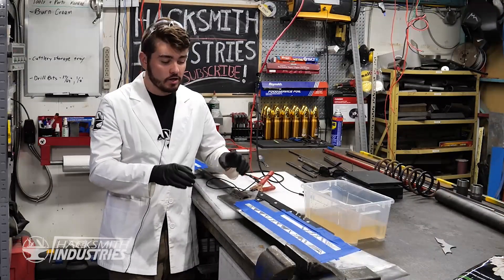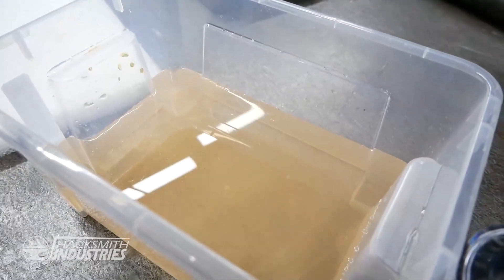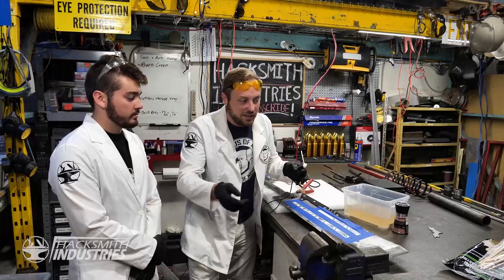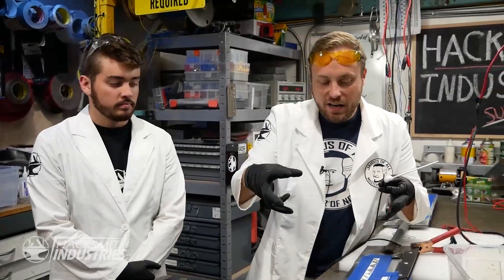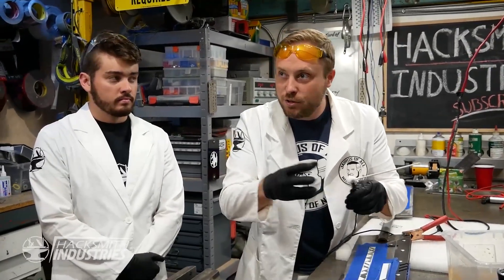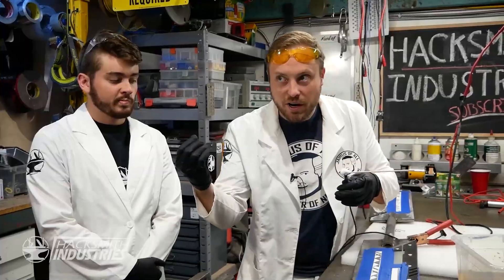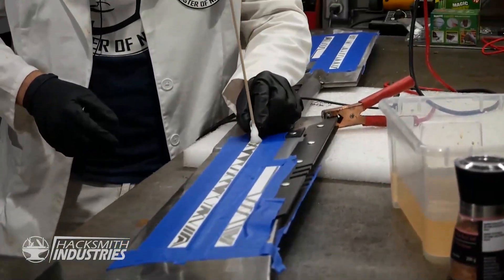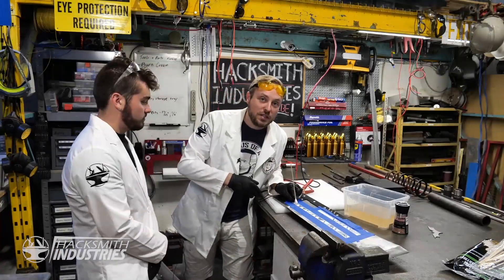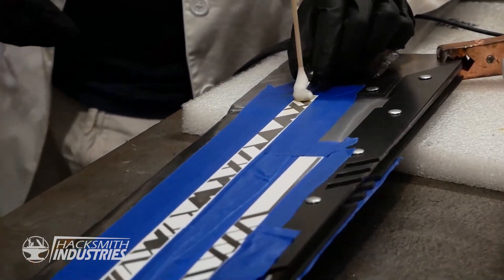We're going to do some saltwater etching to put patterns into the metal. What's going on is we're putting saltwater and electricity on the steel and it makes it go away. You have sodium chloride — the salt — and iron, and you put electricity on it, and something magic happens that makes the reaction occur super fast and the steel goes away. You're basically rapidly rusting the steel. You just need a DC power supply and apply around 32.7 volts, and it starts to burn the steel off.